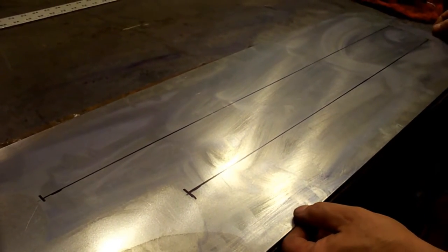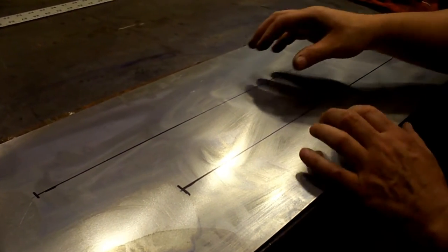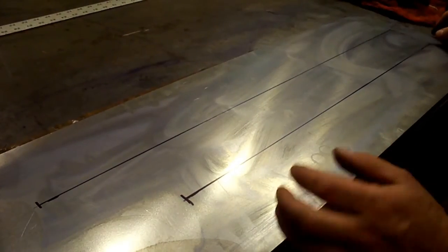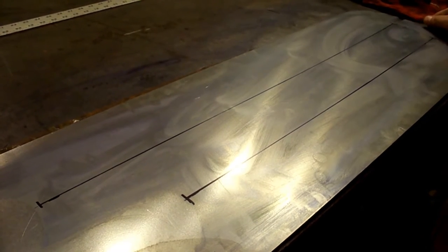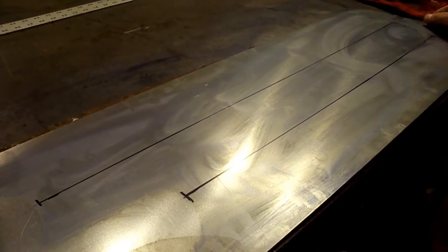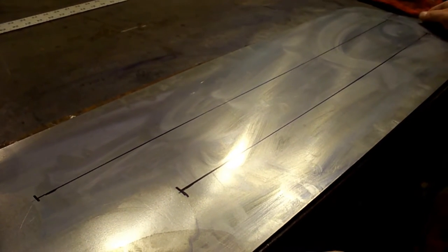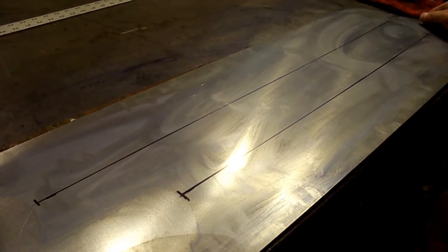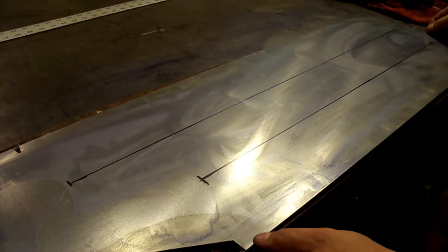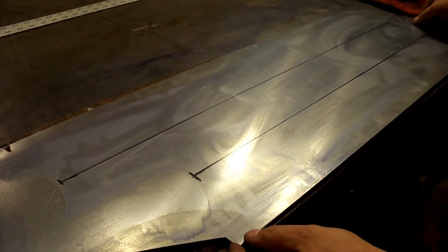Here's our piece with the layout lines on it. I'm going to put the beads in. If this was a really big bead where it was going to gather up a lot of material, we'd run it and pre-stretch it. You'll probably get away with a pre-stretch here too, but I'm going to show you how to do it without pre-stretching and the bead should come out okay. I'll show you the dies I use on the Power Hammer if it's a real big bead, so it'll lay down flat — because it's ending in the center of a panel and that could give you some trouble. So I'm going to set up the Pullmax and start putting the first bead in.